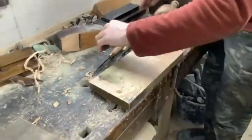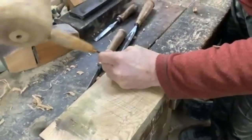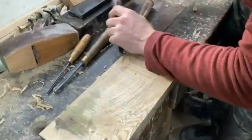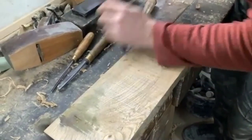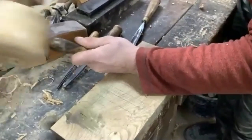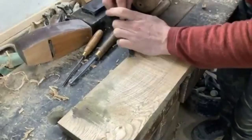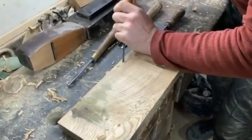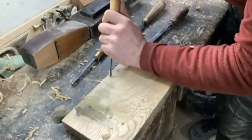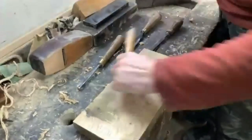There's a little spot in the top - just tap the bulk out and then just finish off this chip with a chisel. In practice you tend to do more than one section at a time. I'll do this cut on a whole load of them in a row - go like that and then like that - because then you don't have to keep doing awkward angles. I'd normally turn the work around. That gives you an idea.